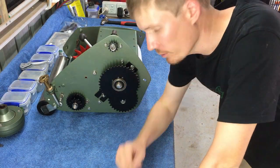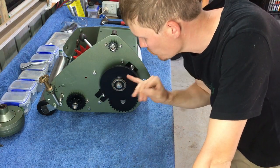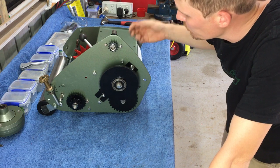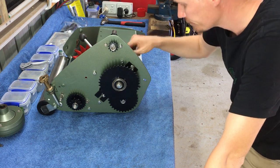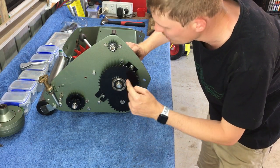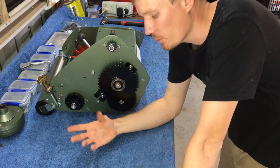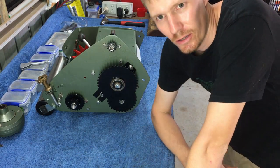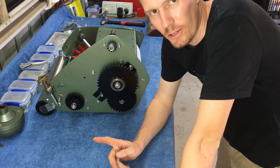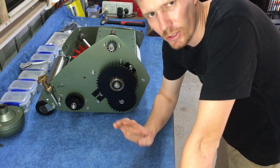I've got that on there. I've put this bolt through here and only tightened it loosely, so this gear should be able to spin freely. How this operates is: once you pull your lever, it pulls weight on the lever bracket at the back, which then pushes this gear into contact with the clutch cork - that will grab, and in turn you will propel forward because it's connected to your rear roller. Let's put the chains on. Once we've got the chains on, we can get some tension on them, and once we've got tension we'll mount the motor.